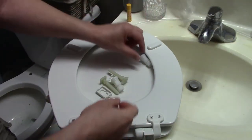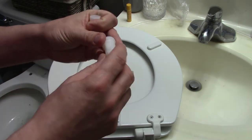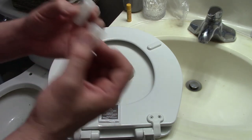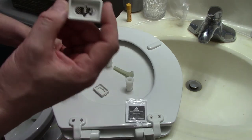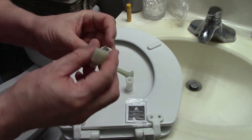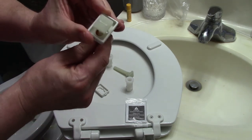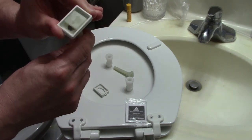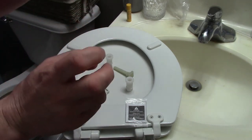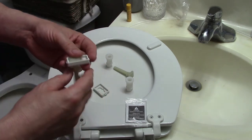This is the clean one — a brand new one. Here we go. So we've got these special locking nuts for the bottom, which is really nice because they have these little breakaway things. So when enough tension hits it, it's going to snap off. And these ones on the new one are set for a 5/8 inch socket, or a 16 millimeter would also work. Then we've got a little plate here where the screws are going to go. Even though it's a screw, it doesn't have a slot for a screwdriver anymore. Now it does have an arrow, so it doesn't matter which way it goes — front and back works. If you try to put it sideways, it doesn't fit. And then these little clips here are what lock the latches on the toilet seat. This one's designed so you can take it off, put it on and off real easy to clean.